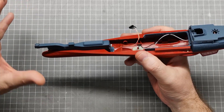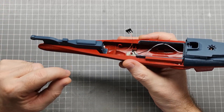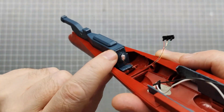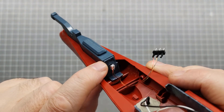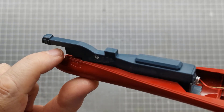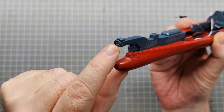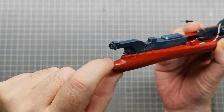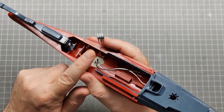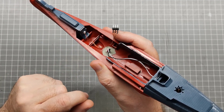In the last video you would have seen me do a lot of the lighting around the guns on the ship. I've started work on some of the other lighting as well. Starting at the front, we've got an addressable RGB LED attached using UV resin to the light pipe, which travels all the way to the wave motion gun at the front, so I'll be able to program it to do the whole firing sequence.